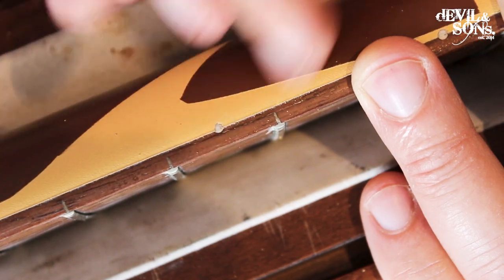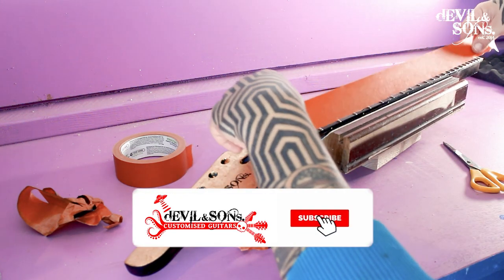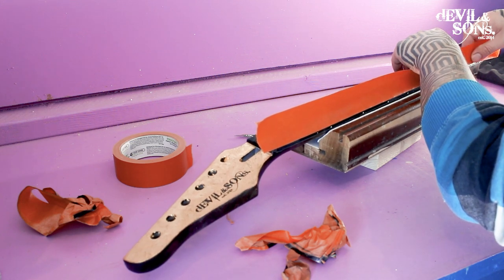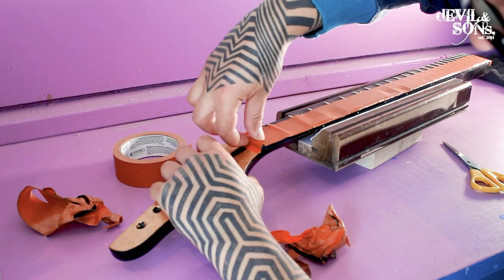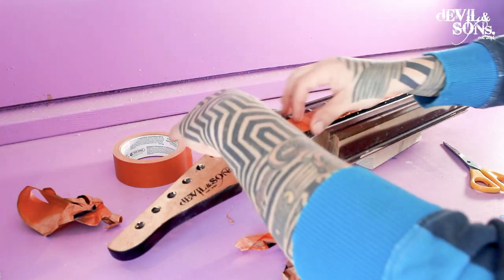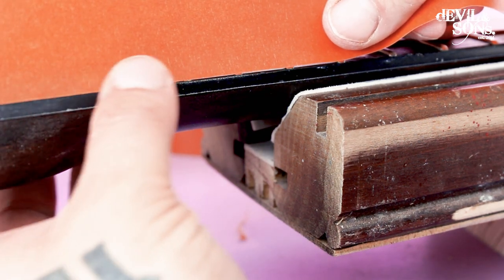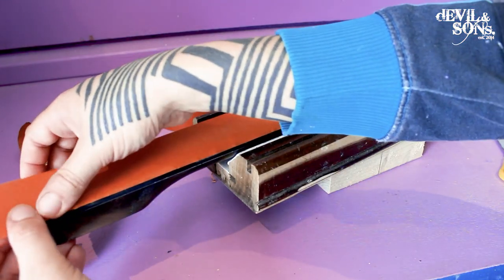This guitar by the way is my draft finish guitar — if you go to my YouTube channel you'll see a final video about that one. Now I'm going back in and masking, but this time I'm only masking the top of the fingerboard. I'm putting my tape on from one end to another and using my thumb to really rub down tight and make sure it sticks to the side of the frets. Then I can fold it over and stick it to the top of the fretboard, but I've got to make sure that I'm not covering the sides and the side dots because I want to varnish over that. By varnishing over that I will help seal in the paint where the paint ends — you can see a slight raised line of the paint catching the light. That's where the paint ends and the fretboard starts, so by putting coats of varnish over the top and sanding we can smooth it out without removing any paint.